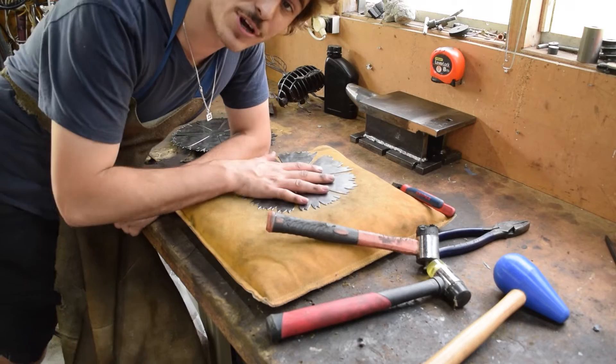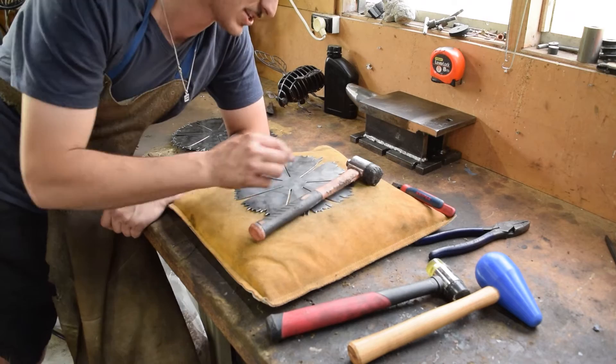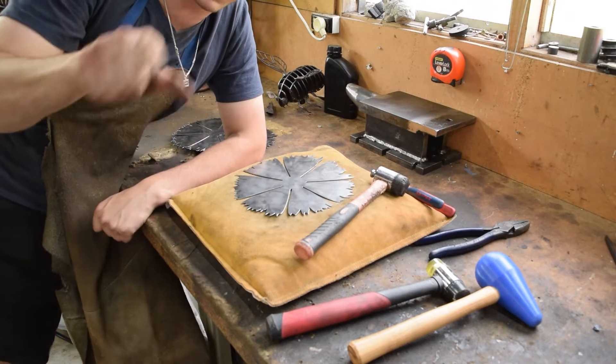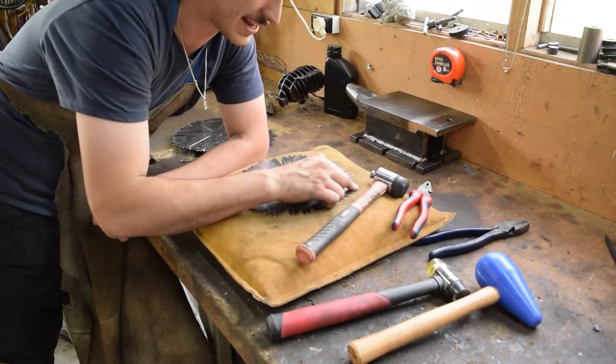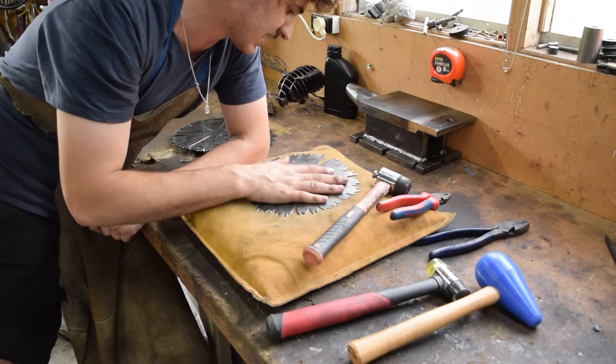Now we're going to do the forming. I like to do the main bit on the sandbag with a rubber-headed hammer. You've obviously got other hammers you can use, but the hammer that comes with the sandbag is too hard and leaves a bit of scalloping, so a rubber-headed hammer is what I like to use. You want to form a nice bowl shape, then create a bit of overlapping and curling of the edges of the petals. I like to do that in the vise with a plank of timber just to clamp it in there — it gives you a hard edge that won't leave any machine marks so you can get that nice curving edge. Then we come back and go over with the pliers. The pliers do just the little curling edges and all these little tears and feathery edges, and honestly this last little thing is what brings these completely to life. In my opinion it turns them into quite beautiful things from just plates of steel.